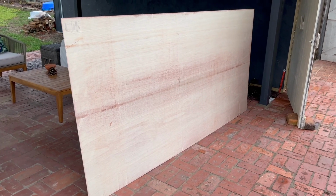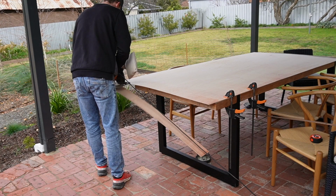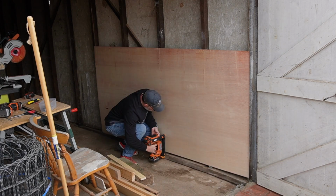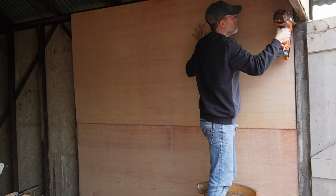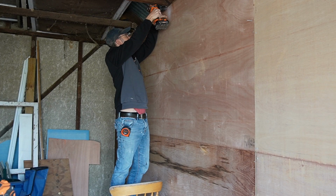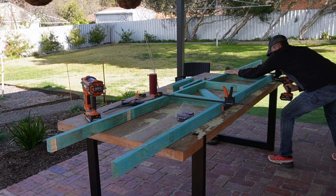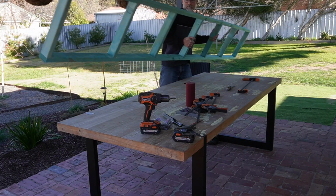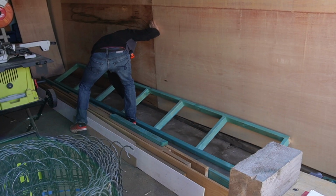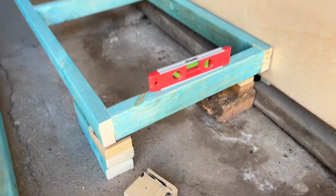Covering the first wall with some thin ply was more cosmetic, as I just needed the studs on that wall for the unit I was going to build. I built a foundation structure out of ply that I could level. And now you can see just how out of level the shed really is.